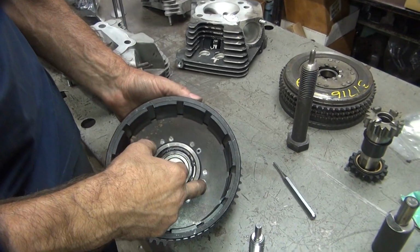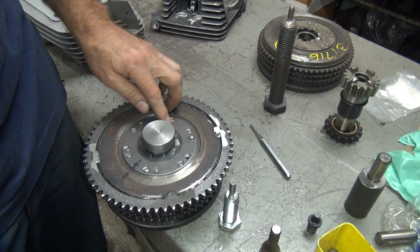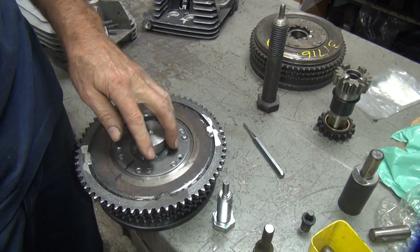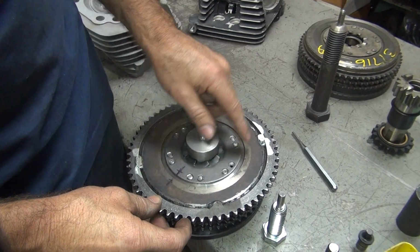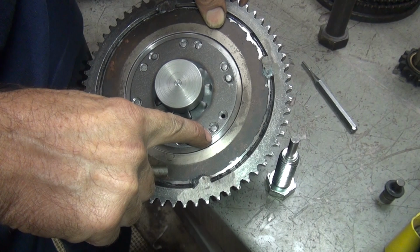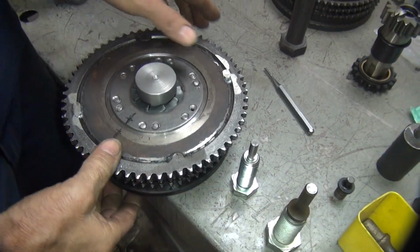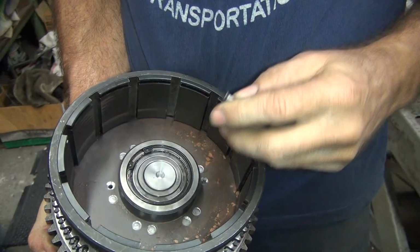So the tapered head goes on the inside, so it's flush in here. And then out here is where the rivet head would be, and I'm making these flush by just crushing them in. So they tend to walk over a little bit, that's why they're slightly off center. But you can see where the tool here pushes up against the basket here. It's a solid press.